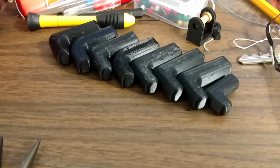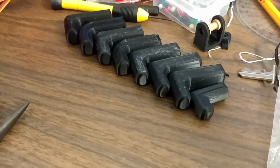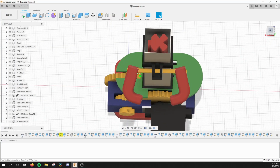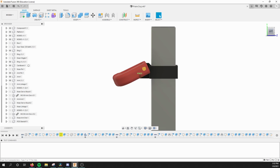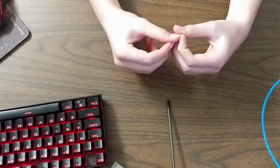The next part was trying to figure out at what angle the arm should mount, and this took like 7 iterations, but I found that the best angle was slightly outwards, because that's the natural direction of his fabric fur, and slightly downwards so that the servo could get the most range of motion out of it, along with not having to put too much torque into it.